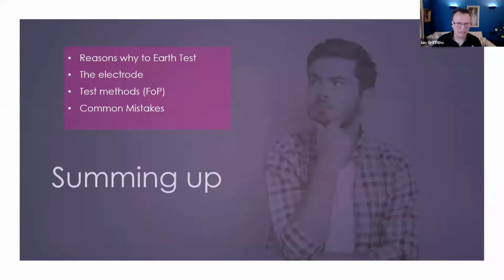Okay, I'm conscious that time is now ticking on. Summing up, and I hope this has stimulated a few questions. We've covered the reasons why we do earth testing. We've covered a little bit of the basics in terms of the electrode and its function. Remember, it is designed to provide an interface with the geology. So that interface is what we're measuring when we do an earth test. And the electrode is designed to leak current and voltage. And we covered a few test methods available, but we focused in on the fall of potential because it is the most reliable, accepted and commonly well-known method.